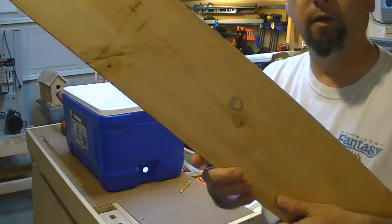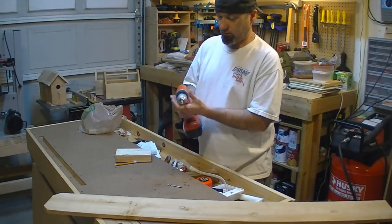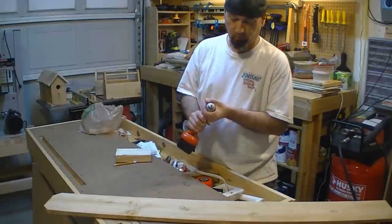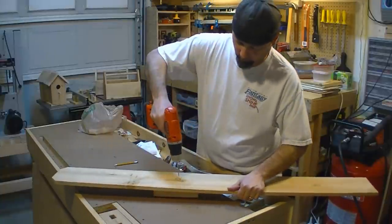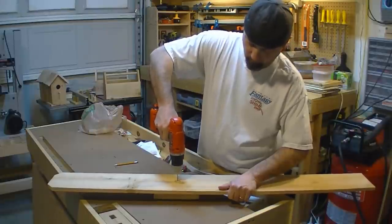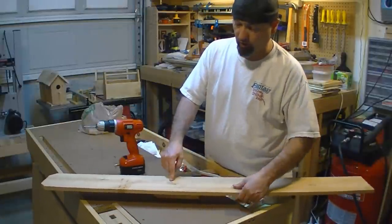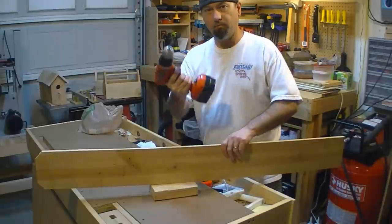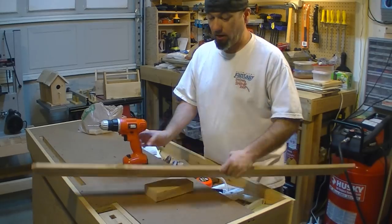This gives you a rough idea — here's the circle I just drew. Now I'm going to get my drill and put in a one-eighth inch drill bit. I'm going to put a one-eighth inch hole right in the middle of that circle. Now I've got a one-eighth inch hole. Remember, where I drew the circle is on the inside of the box, so I took the ice chest out, got the drill, and drilled through it. That is my pilot hole.